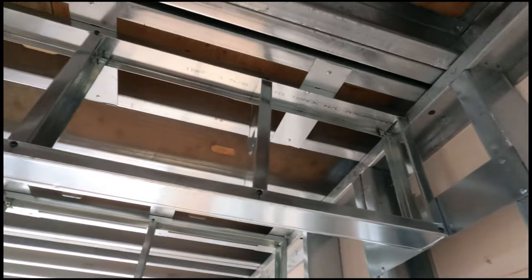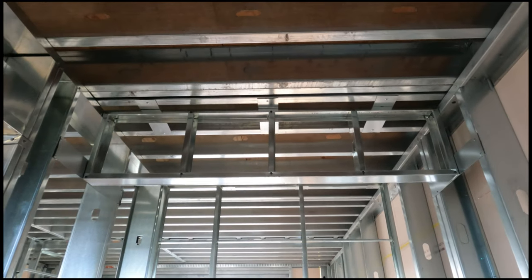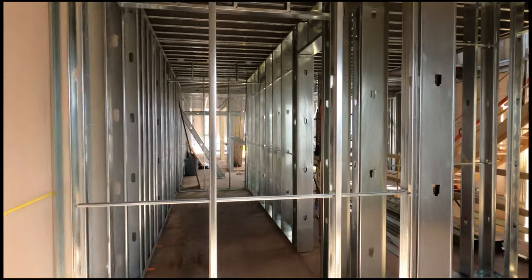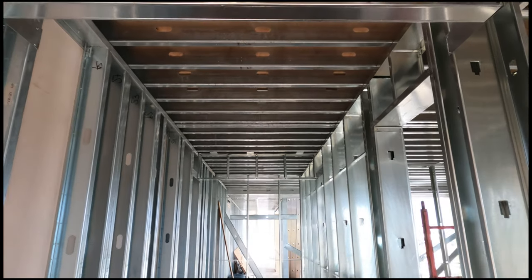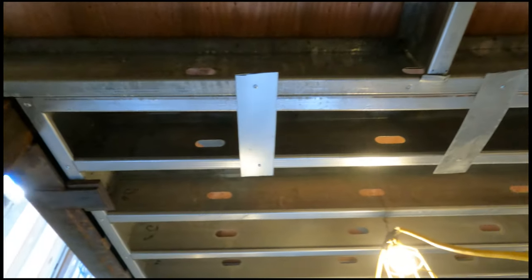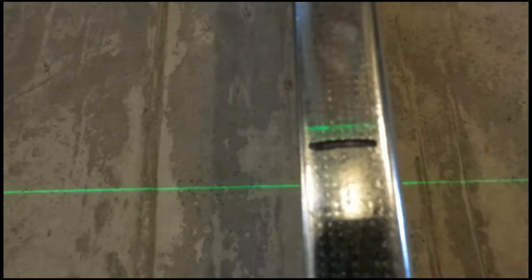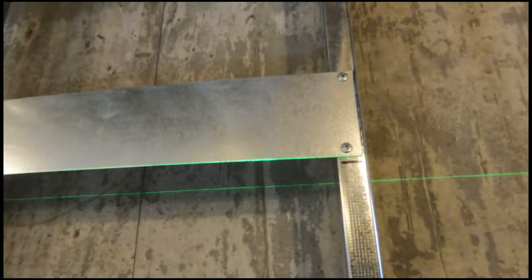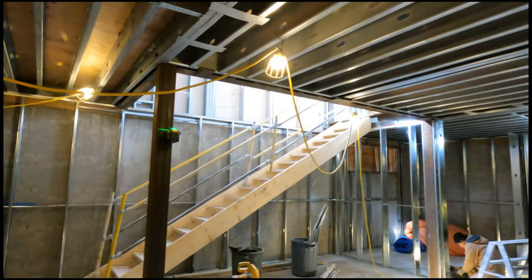I keep the end studs up a quarter inch from the clip so I have room to get the bottom track on. This is a simple one for pocket doors inside a bathroom — you can see me hanging on it right there, literally just hanging on it, super strong. I have three clips and the end studs are screwed in. I've marked both sides for elevation — say it's eight foot — and you can see the other side's mark was higher, so I'm going off that. You always go off your high side. I put the clip right at the elevation so I know where to stop my ends and where my side tracks are.